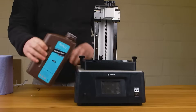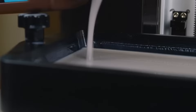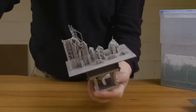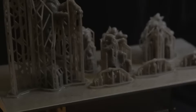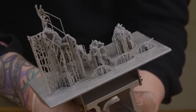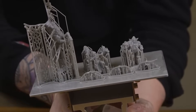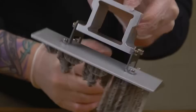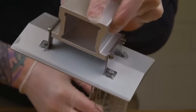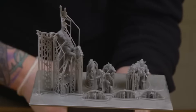The first thing that really shocked me about this resin is how thin it is. It's hard to portray on camera, but it's like the consistency of milk — very, very thin. The pro to this is when you leave it to drip off the build plate, almost all of it comes off. There's surprisingly very little on the models, apart from in the eye sockets. The resin just runs off, especially when it's at a good temperature, 20 degrees and above.